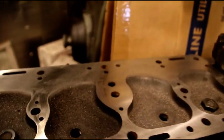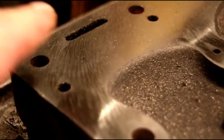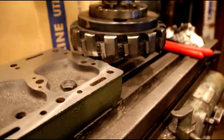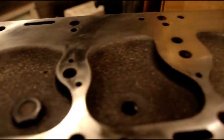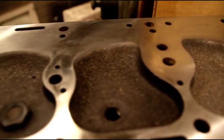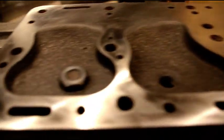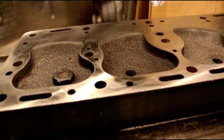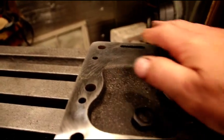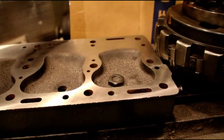Got the whole cylinder head cleaned up and I have to make one more pass. I don't know if you can see it, but you can see the marks from my cutter. When that cutter head gets dull — and cast iron is really tough on those carbide bits — I don't like the finish. I'm not happy with the finish here. We did clean up, but I'm 11 thousandths deep right now and I did not think it was going to take that much to clean this head up. I'm going to go another thousandths and clean up all the stuff I don't like in here — that will be a perfectly flat head. From here to here we had a terrible low in there, which is a perfect place for trouble.